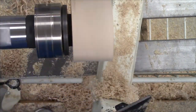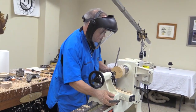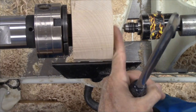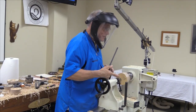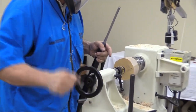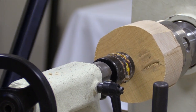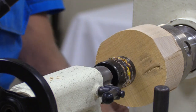I'm not going to talk a lot while I get this set up because I want to go rather quickly. I want the chuck set all the way in and I like to have one finger width — after the chuck is set in — between the piece and the chuck. Lock it down and then set it in with the quill. Otherwise I'll occasionally slide it up and the live center won't be set all the way in the shaft and then it starts wobbling. Lock it in, turn my speed down.